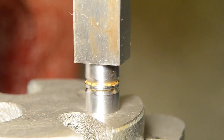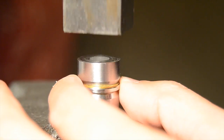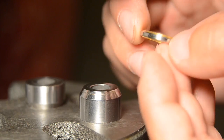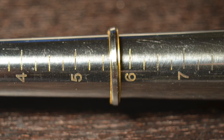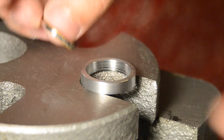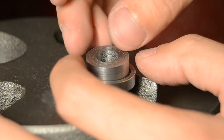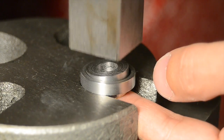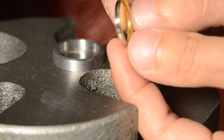The thinner ring was an interesting case. I ended up pressing it quite a lot — in fact, I bottomed out the two swaging dies so they were resting on each other rather than pressing on the gold. I thought this was due to a miscalculation in size, but it turns out I had stretched the steel ring. It was supposed to be a 5.25, and you can see the edge is a bit tapered — it stretched more on one side. My solution was to make a tapered die with a hole sized so the ring could only pass through after being squeezed back to the desired size, but it didn't work. The steel was too elastic — it passed through the die but sprang right back, so I just left it as is.